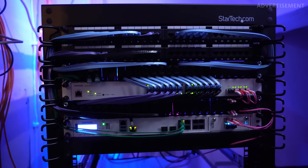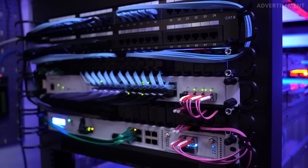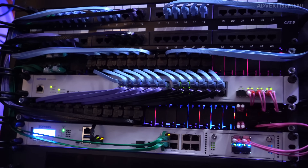These were some of the cable changes I made to the rack. I know it's a lot of work and it took me quite a while to finish, and it's of course completely oversized for my small homelab. But having a nice looking homelab is what I just love, and clean, organized cable management is a crucial part of that. So the tips I can give you from my own experience: have a big patch panel with enough ports, don't invest money into Cat7 or shielded equipment if you really don't need it, and consider adding a second patch panel at the back of your server rack to have a solid connection between the front and back that keeps things cleaner inside.